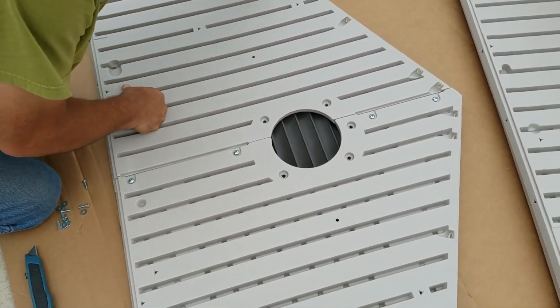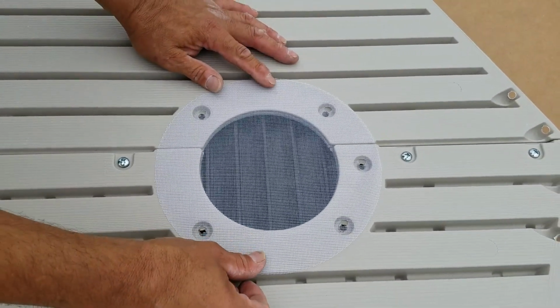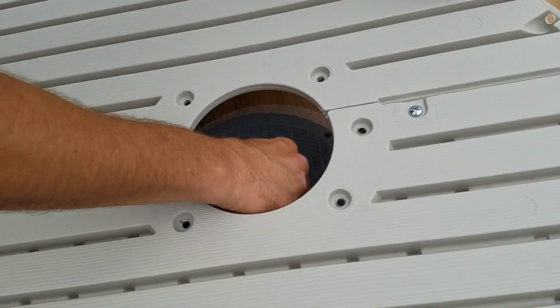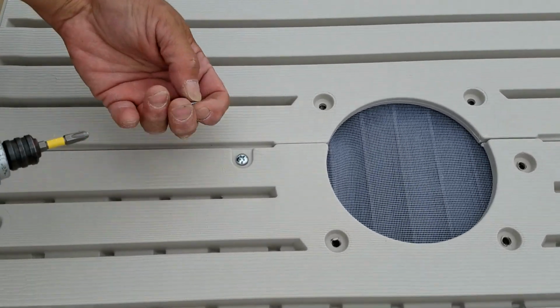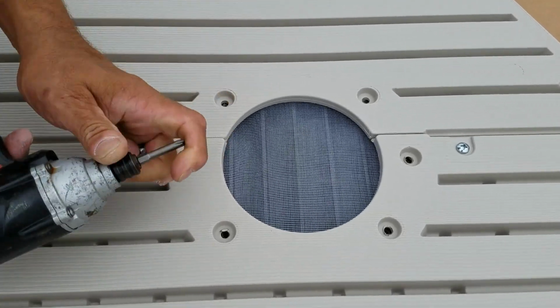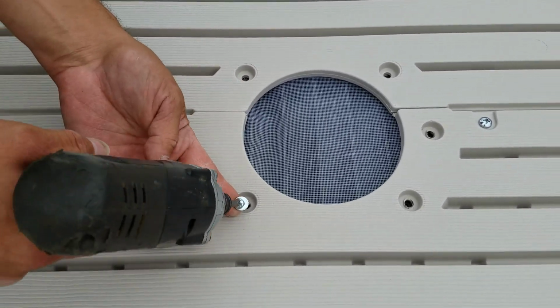I line up all those holes, 3 on the top, 2 on the bottom, where you can see through to the vent underneath, and then you line the screen on top, and just as you see there, it's all lined up perfect. That simple. Lift up, lift down, or bring down, and then you should look through each one of those holes and see the hole in the vent that the screw gets a washer and then gets screwed in.